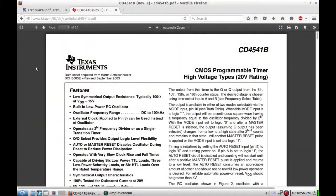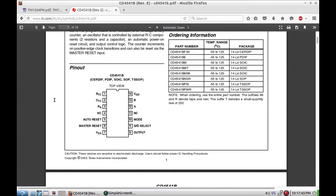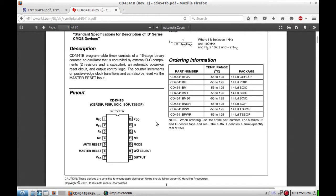I looked up that 14-pin chip and I was wrong about the part number. It's actually a CD4541B by Texas Instruments, which matches the labeling exactly — and it's not a charge controller, it's a timer. So this thing doesn't actually sense the charge current and shut off; it just runs for a certain amount of time by the looks of it. The board has enough corrosion and pollution on it that it's really hard to trace what's going on, but the general pinout matches what's shown in the datasheet, even down to pin 4 and 11 not being used.